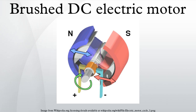Heaters are external thermal overload protectors connected in series with the motor's windings and mounted in the motor contactor. Solder pot heaters melt in an overload condition, which causes the motor control circuit to de-energize the motor. Bimetallic heaters function the same way as embedded bimetallic protectors.